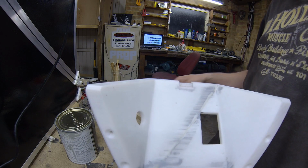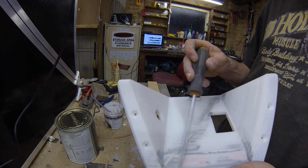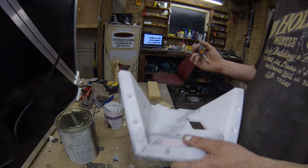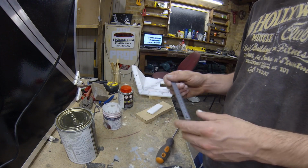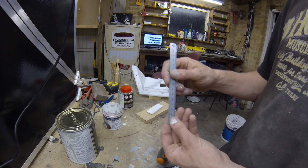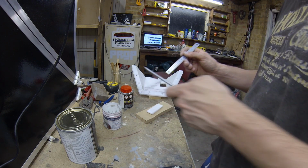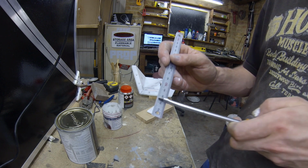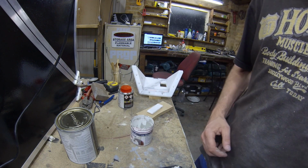I've got this piece here I have been working on. I had to print it in two pieces, so I've already joined it with two-part epoxy and lightly sanded it off camera. As per the Concept Paints HS 2K Primer technical data sheet, I'm mixing the material at 4 parts primer and 1 part hardener.